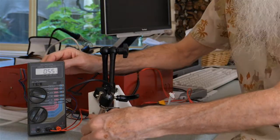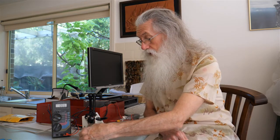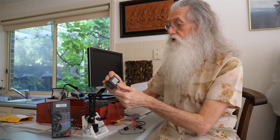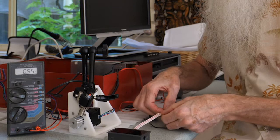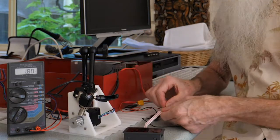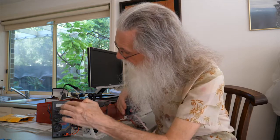All the instructions are in Chinese, so you melt a few wires testing it up. It's reading 0.5 of a volt — spinning it across — up to 11.5. I just run it off a LiPo battery. So we know it's putting out the supply voltage, which is good. I think it's up to 30-odd volts that these things can switch — 8 to 30-something — which means you've got to make sure whatever's receiving the signal can accept that. It works fine. The sensor is glowing, the buzzer is buzzing, and we've got 1.8 volts.